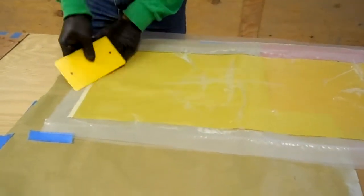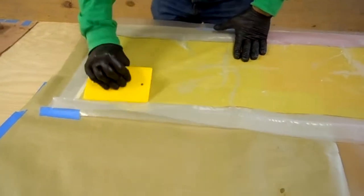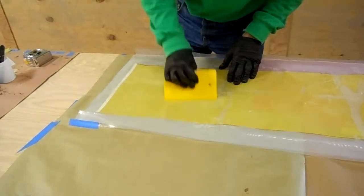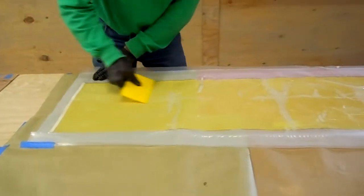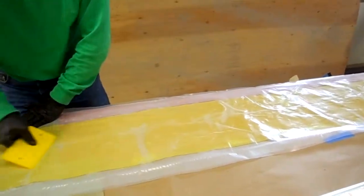If I work hard I can probably squeeze a little bit more, but I'm a little nervous — I don't want to squeeze all the resin out. I want enough that there's something to bond to the Rohacell. It's possible to make it too dry. So now I'm going to take this last little bit and just spread it around, smooth it all the way through, and see what comes out the other edge.